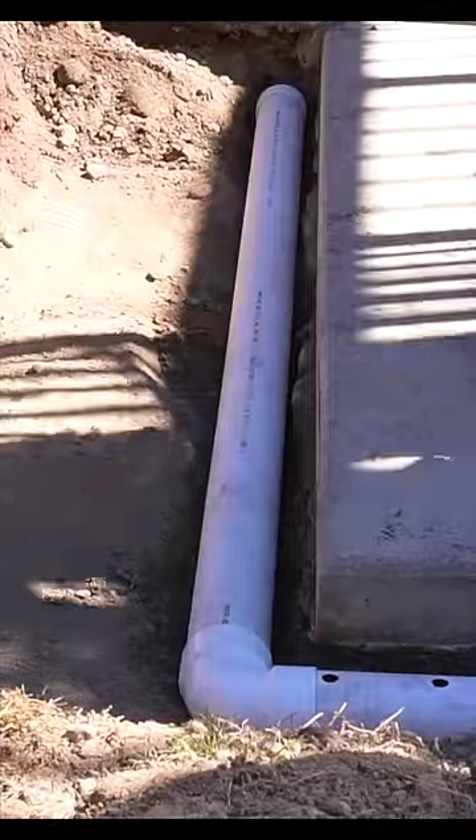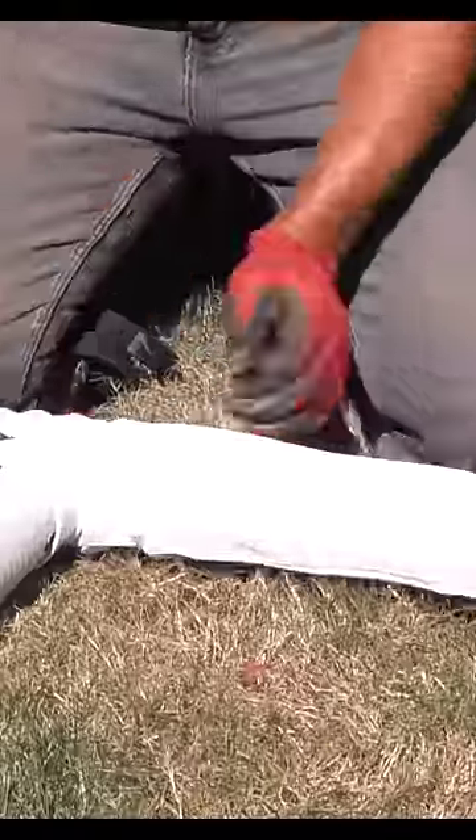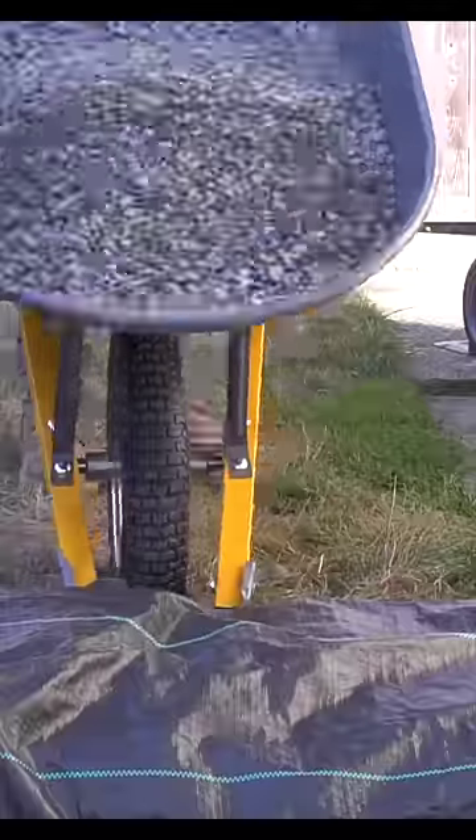You do need to make sure to place a sleeve on this system so it works properly over time, but once that's on you fit it into place, place your crushed rock right on top, compact it, retaining wall, and we have one properly drained system.